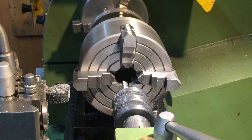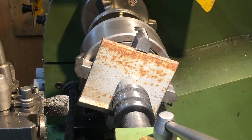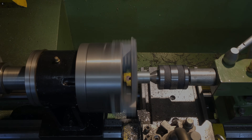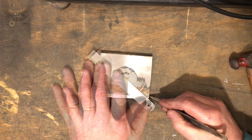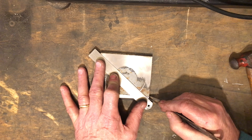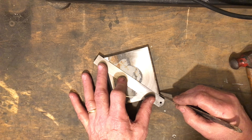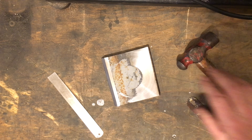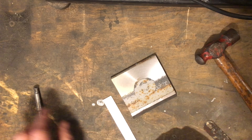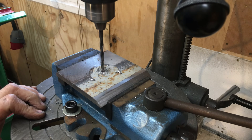What I did was drill a hole through all of them so that they could be very tightly bolted together on a single high tensile bolt. The holes had to be marked and placed central to the thickest part of the material rather than the extreme corners. I did this to ensure that I got the full washer out of all eight plates. If I got one or two wrong then I was still ahead on parts because I only needed five threaded washers. The remainder were projected to become balance weight rings which were going to be smaller diameter.